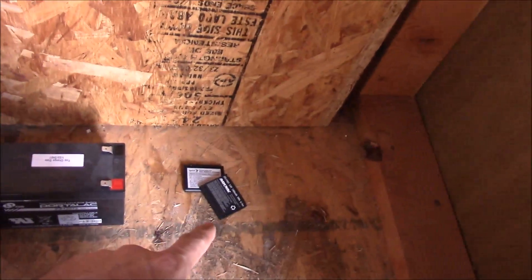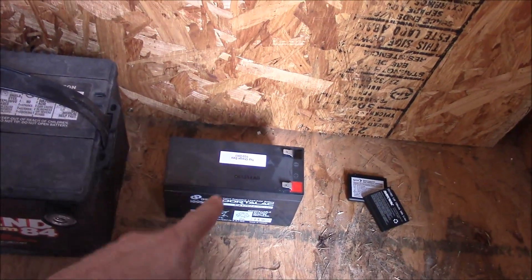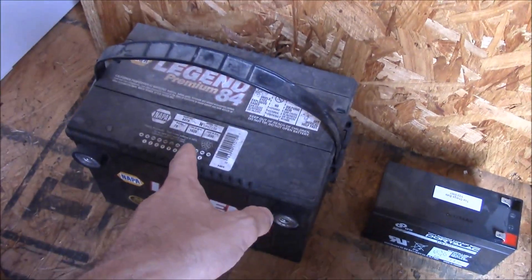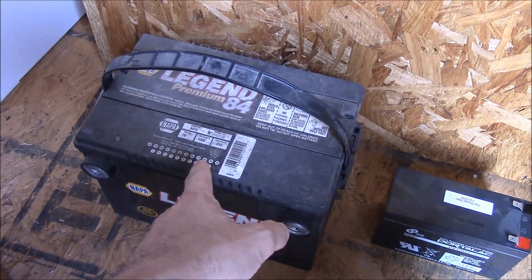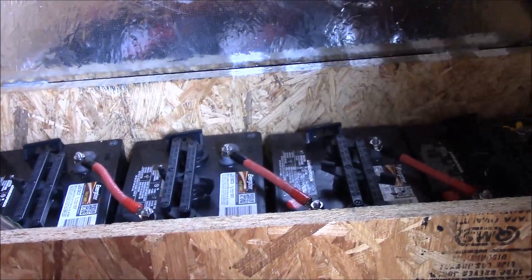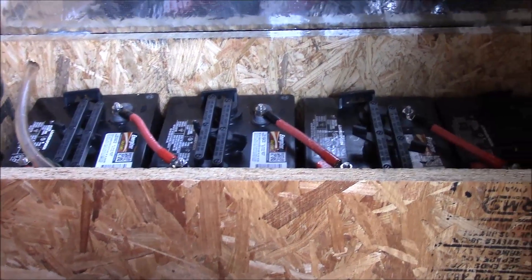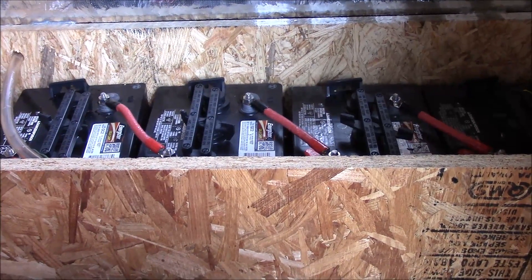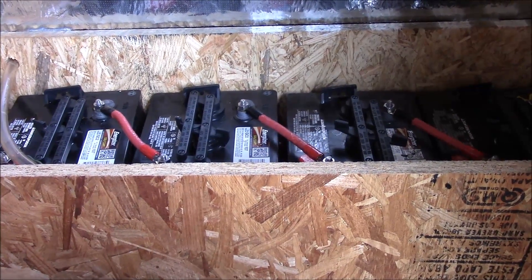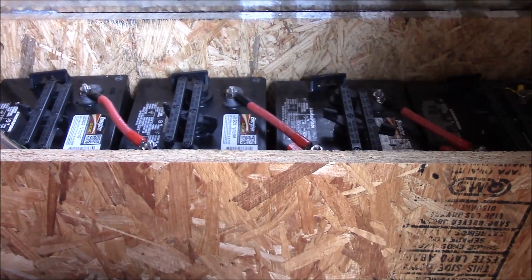So let's review. Lithium ion: technology is not there yet. Sealed lead acid: perfect for small systems — say you've got a 20 watt or 50 watt panel or under, these are great. Don't use a car battery unless you absolutely have to, or you don't care if it dies, because you may kill it by over-discharging it. And golf cart batteries, renewable energy batteries, telco batteries, deep cycle marine batteries — anything that's deep cycle or meant to be discharged and recharged over and over again, that's what you want to use. That's going to save you money in the long run and take the abuse.